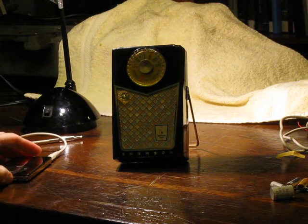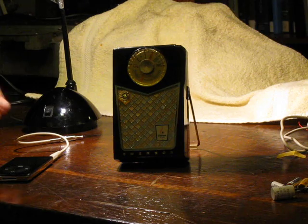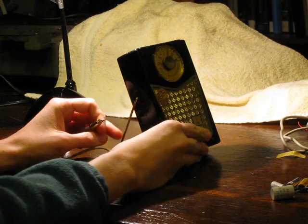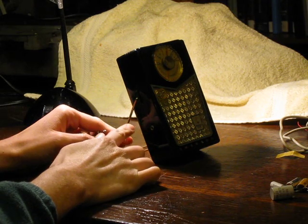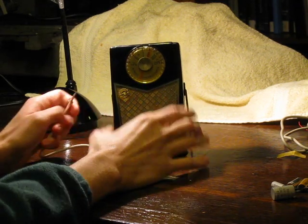What I like to do is play my iPod through old radios. I modified this one so that it would accept the audio input from my iPod. I did this by actually hacking the audio output jack and turning it into an input jack that automatically switches off the radio's audio once this is plugged in.